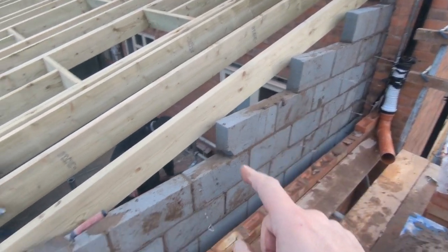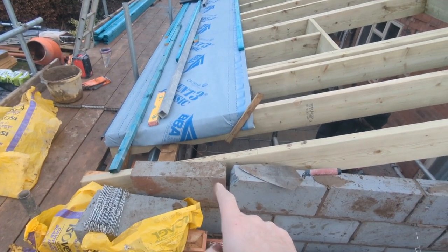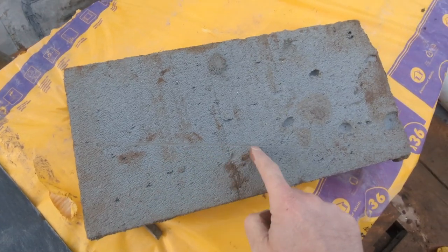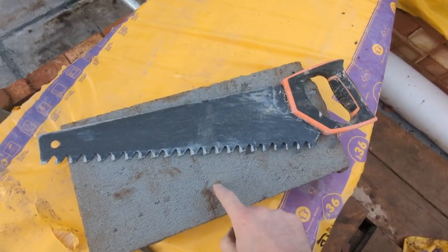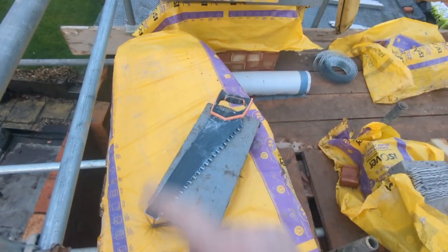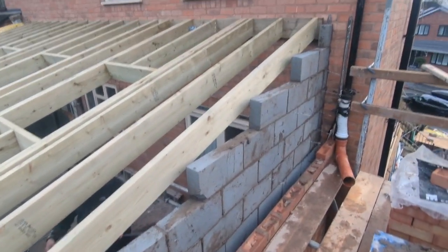That's all built, full blocks only - I've come all the way down. Starting at the bottom, where my first cut's going to be - you just put one full block on completely dry, don't put any compound. Run your trowel along your rafter down the block - that will mark the block. Then you just cut it roughly 25 to 30mm smaller with your block saw. That will take into account the compound you're going to put on. Continue that all the way up, and use the off-cut - whatever you cut off, especially the first couple, they will come in somewhere. So don't go cutting them all at once, because trust me, you will use them up.